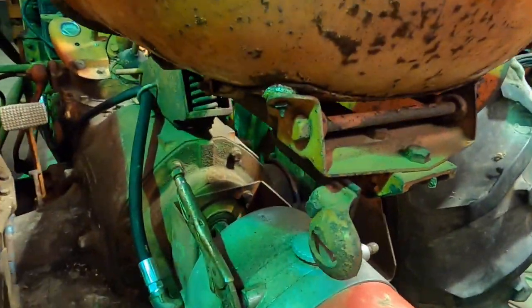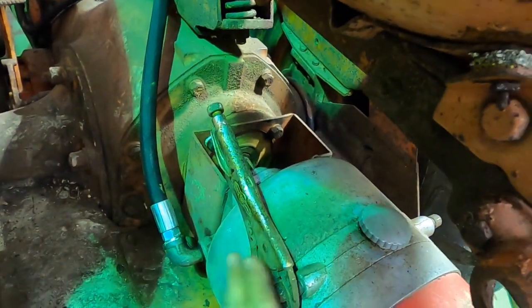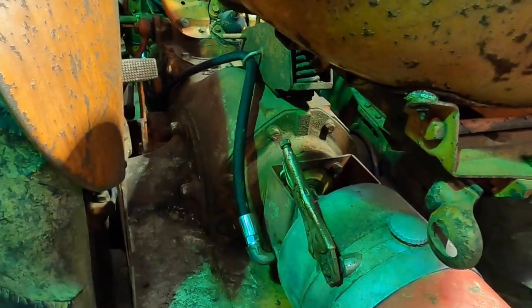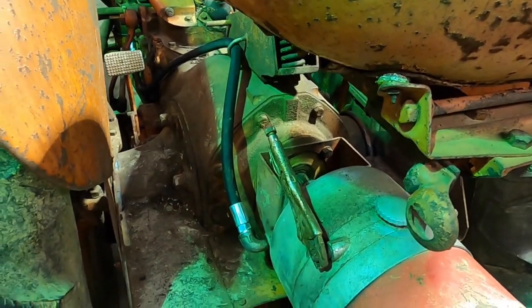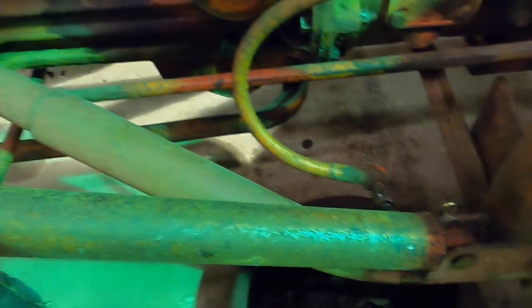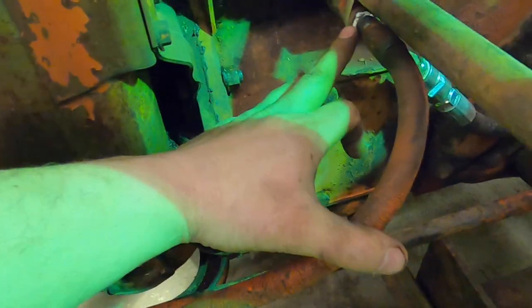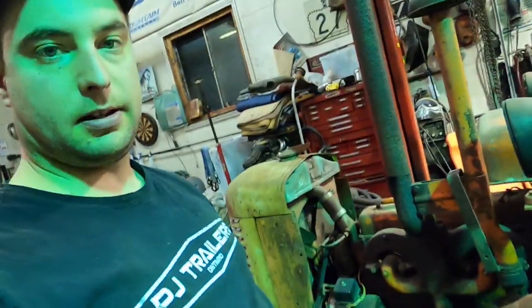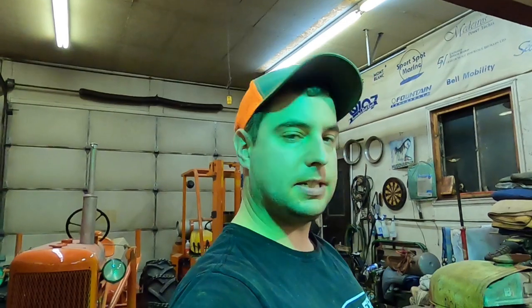So this is your Charlin hydraulic pump and reservoir assembly — fluid goes in the top. We got a new main feed line. Now, these aren't dual hydraulics — they're only single-acting, so it's hydraulic pressure up and gravity down. But for what Andrew's going to do, it's going to work out perfect for him. The line plumbs all the way up to the front. These are just some old Allis cylinders I had kicking around — his leaked like a sieve, so we got that fixed up. They tee off together: one goes across the tractor over to the other side into the other cylinder. It's a very, very simple setup. When we get the loader hooked up and I take it back to him, we're going to film that as well. That's going to do it for this episode of Ontario Vintage Tractor — if you could like and subscribe, we'd really appreciate it. Catch you on the next one, take care.